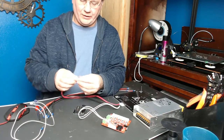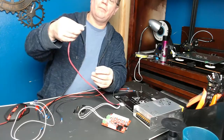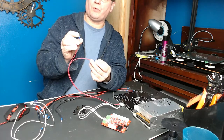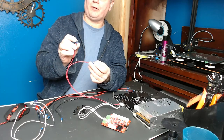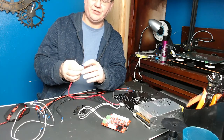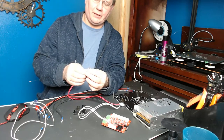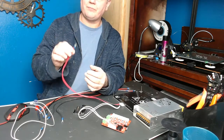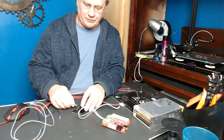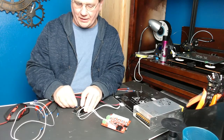What I do with these double wires is send them back to back — there's one side there. If you're doing this yourself, make sure you find spade connectors with really narrow ends. Gardner-Bender makes ones I recommend. I also strongly suggest soldering these on. Crimping and soldering together makes for a better connection, and loose connections are where a lot of this heat gets produced. So you want to avoid loose connections wherever possible.